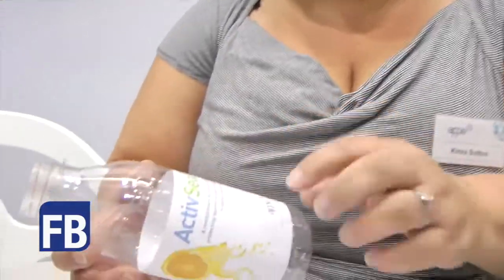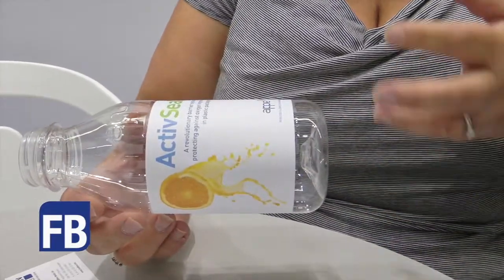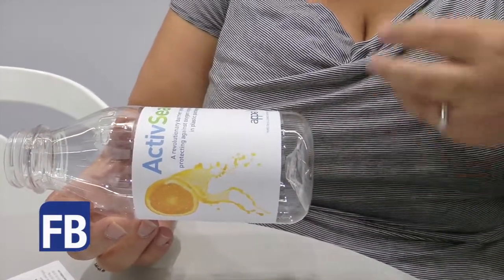It's a huge deal. The difference between this and other barriers, with traditional nylon barriers, the nylon is actually injection moulded into the wall. That has a consequence of making it hazy or cloudy, so the bottle is not truly transparent. It also has an effect on the recycling stream. You cannot separate the nylon that's built into the PET wall, so it therefore does contaminate the recycling stream.